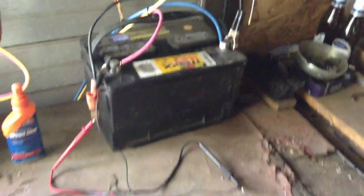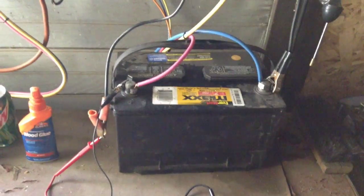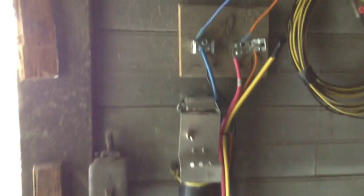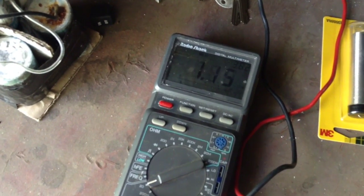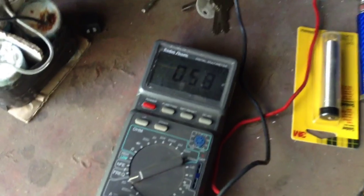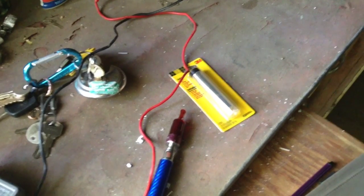Another thing here: I had this just on the wind turbine itself, and when the wind would pick up and I hit those four amp marks yesterday, the battery voltage would go to 15.6, 15.8. So what I did is I got some heavy gauge wire and just ran that back to my terminal block, so it's tied in with the rest of the batteries. Now when it's charging with the wind and the solar, the three batteries in parallel will absorb the shock of the high voltage a lot better. So I got some more solder and I'm going to go ahead and pull this thing down and wire it for six coils in parallel and see what that does for my amps.